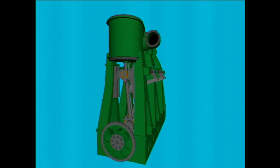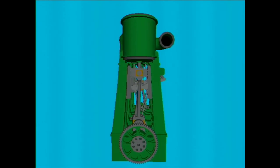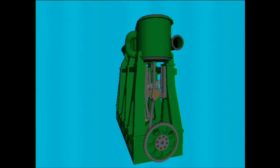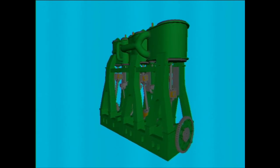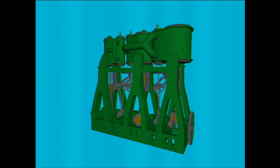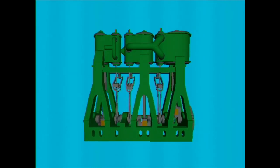Well, the thing is, this is actually intended for Windows window mode, but Voodoo 2 can't do that. So it's really not intended to run on Voodoo 2 cards. But I found out that it was a pretty good tool just to test the FBI chip. So as you can see, we're artifact free. And if you see some dots down in some places, that's the model, the way I made it. It happens. It's not artifacting from hardware, it's just how the model was created. But anyway, that's working. So we seem to have a good working FBI chip.